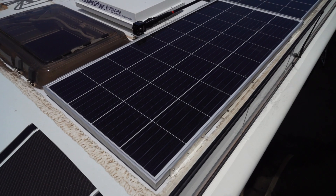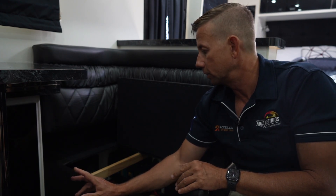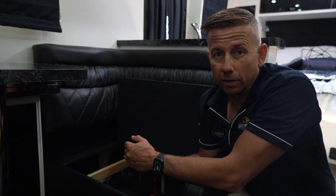We've got five 180 watt Enerdrive solar panels — that's 900 watts — coming in under 60 amps, so this solar reg won't be working to its max; it's the right size for the system. I'd expect it to do something like 50 amps in full sun. The reason we use this one is it's silent. I try not to use a solar regulator with any fans in it — sounds like a good idea until you want to sleep during the day with your solar cranking and fans running in the van. We can program these solar regs individually to suit whatever batteries we're putting in, and it's a bulletproof product that Enerdrive recommends.